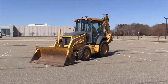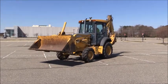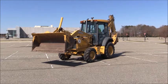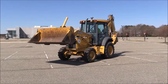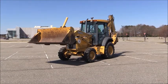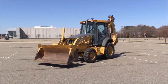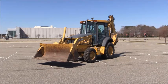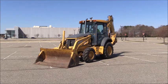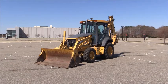Now we'll give a visual representation of the front bucket. As I stated before, this works exactly like the loader. You pull the left handle back to raise your lifting arm and bucket up. Pull inside towards me to the left and it controls my pitch back; push it out and it pushes my pitch down. While I still have it up, I'm going to show you the right control which opens and closes my bucket. As I go down, this backhoe has a guide tool on my right hand side which you can only see from inside the cab — it lets you know when your bucket is actually level because there's a line right here. It's also equipped with what they call a float motion: when you push your bucket all the way down and jam the handle forward, it puts it in float motion, so if you're back dragging or trying to pull something back, it allows your bucket to float on the ground and stay level.